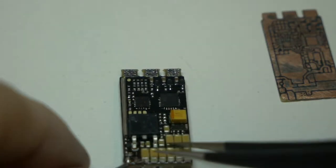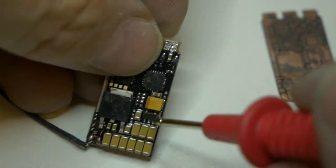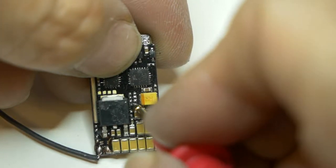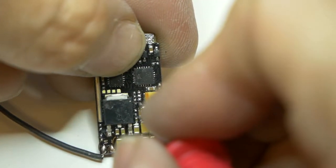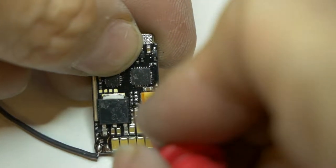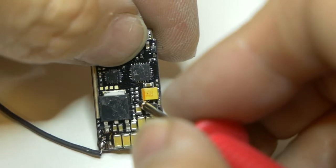So I've got a wire here, got a multimeter here, and so then what I can do is I get right in here, and there it is. So now it's good. No confetti yet, exactly, but I could maybe solder a signal wire from here onto there. Again, remember, on the pad that's broken. I could solder it onto there if I can, without touching all the rest of the stuff around there.